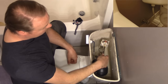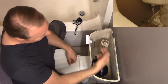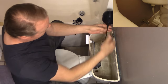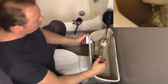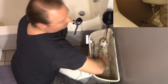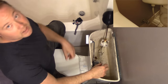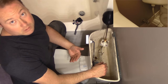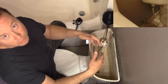That should be done — you'll know it's done if you can push this down. We're good and quiet, there's no noise, so there's no more water. Now we've got to get the water out of the tank. Let's grab the flapper rather than holding the flush lever down — let's just get the flapper out of the way. Most of the water's out, but as you can see there's still almost an inch of water sitting there because of the lip where the flapper goes. You want to get rid of that so you don't make a big mess.